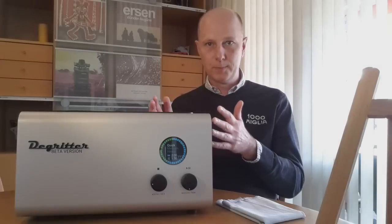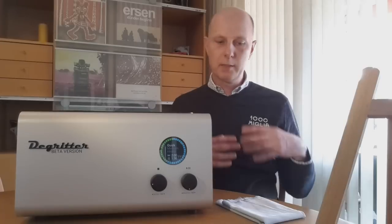If you increase the frequency, the dispersion of the bubbles is also much less. To give you a rough idea, if you put 100 watts of energy into the water and you have 100 bubbles, you get 1 watt per bubble. If you double the frequency, you go from 100 bubbles to 1000 bubbles, but the power of one bubble is 0.1 watts. So that reduces from 1 watt to 0.1 watts. You get a more gentle cleaning, but you have a crazy amount of bubbles in the water, which are rubbing and, by cavitation, cleaning the record.